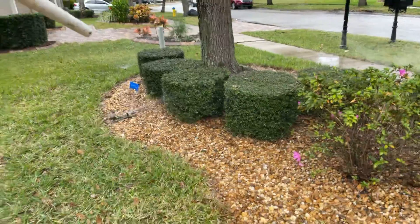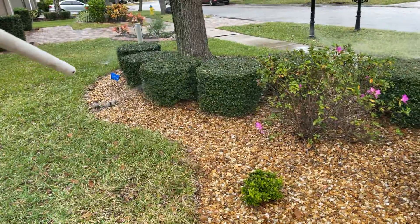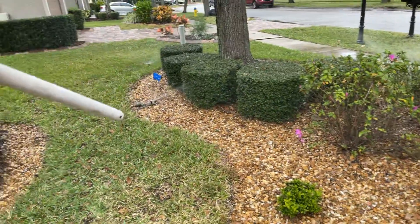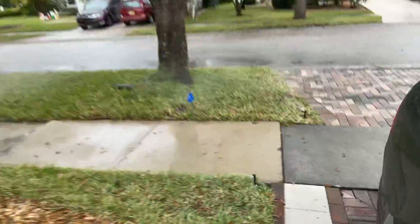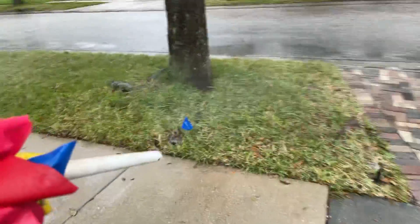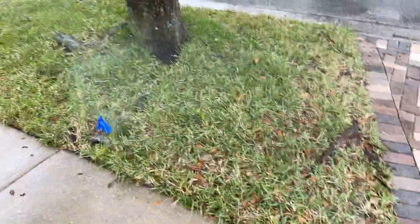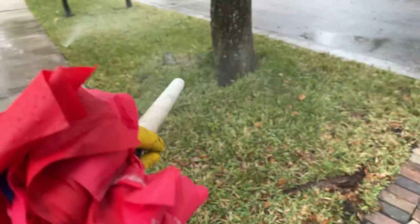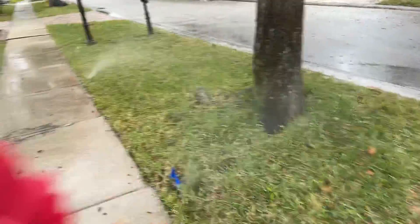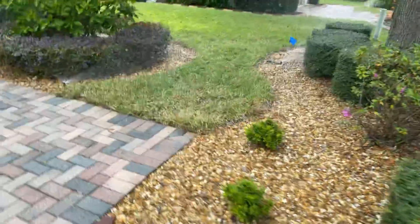There's another pop-up on the front end over there. There's no need for that sprinkler, and plus it's around roots — it's better to cap it off and avoid further problems. Then we have another sprinkler here that also needs to be capped off. Around this root, to avoid problems. You can put a pop-up here instead and use a 15-foot nozzle to cover this whole section perfectly.